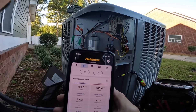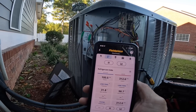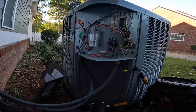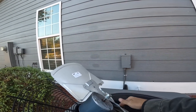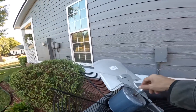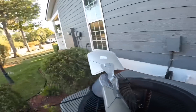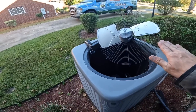My pressures are back over 300. This thing's doing good. I've got to check my bearings and remove any leaves that might be in there. I might just get the water hose and go ahead and wash this out. I put in a five-ton unit the other day that was like this tall.